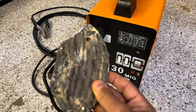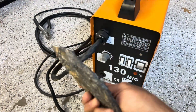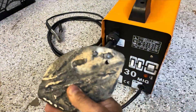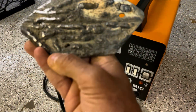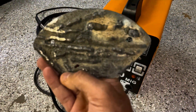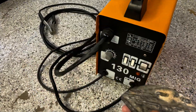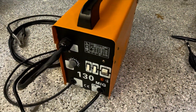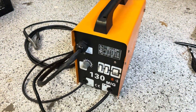You can see it's putting up very solid welds. In my opinion it's good enough for DIY stuff. I've been practicing my welding skills and it's putting really nice welds compared to what I started with. So I'm going to open it up and show you what I did to modify it from AC to DC output.